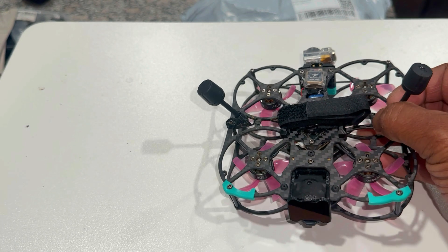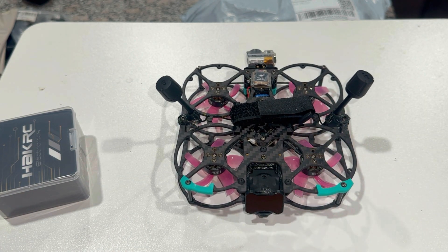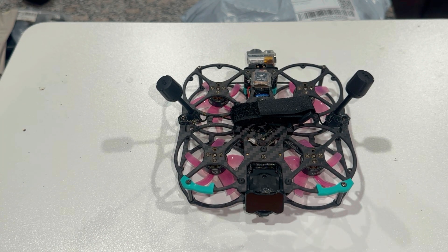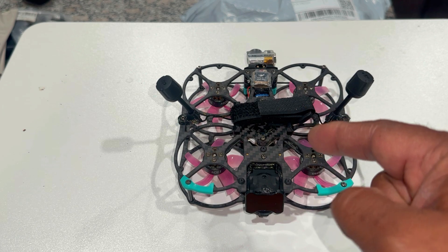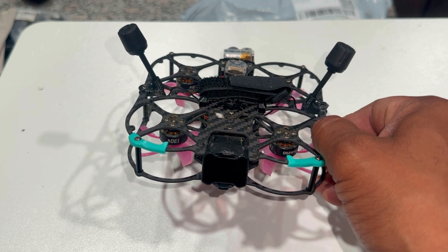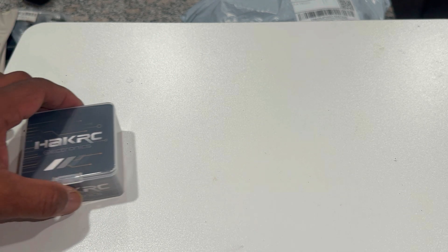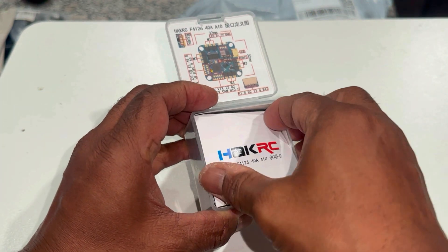The purpose of this buy is I want to build another 3.5-inch drone. Even though I'm used to building 10-inch drones and flying them in different countries, I needed something I could just take with me in a backpack and fly. The Huma is perfect when there's no wind, but if there's a little bit of wind I'm having problems. That's why I'm building the 3.5-inch quad, running 4S on an 850 milliamp battery, so I can use the same batteries across builds and carry less on the airplane.